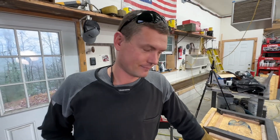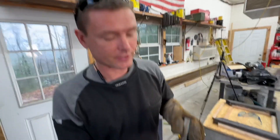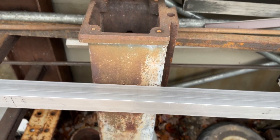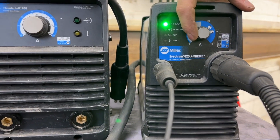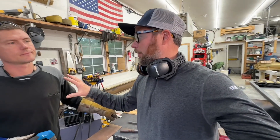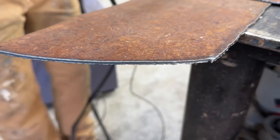So what does $5,000 get you? You can cut a variety of thicknesses of metal, from super thin sheet metal all the way up to five-eighths of an inch thick, which is really awesome. You can also cut things you may not be able to clamp into a saw — something you can't really move — by bringing the plasma cutter to it, so it is somewhat portable, though it does take 220 power. The main advantage is that you can cut odd shapes: anywhere you can draw or move, you can cut any shape — a circle, a squiggle, it doesn't matter. You can also cut a straight line using a straight edge to keep yourself running straight. The main disadvantage is that it does leave an irregular edge on the piece of metal that has to be ground or sanded in order to weld it to another piece and have it look good.